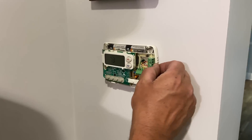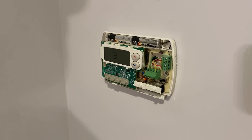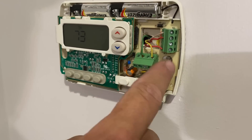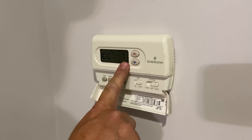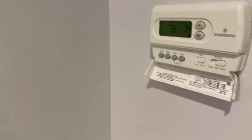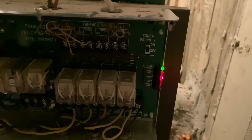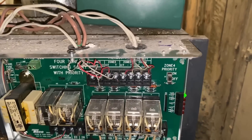What I was doing was basically touching those two wires together — jumping RC and RH. Now it's off. The jumper's gone, and there's a little switch here that says ELC and GAS — we'll let that be for now. Let's flip the system switch from off to heat, set for 71, flame icon, 73 degrees indoor ambient temperature. Watch what happens when I go to 74 — click. That's the heating relay closing. Zone 2 light is on, then he turned it off. It was that little jumper causing the issue.